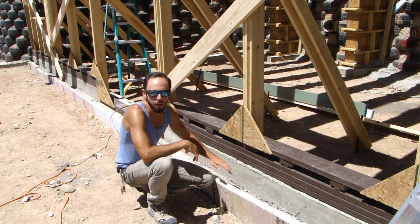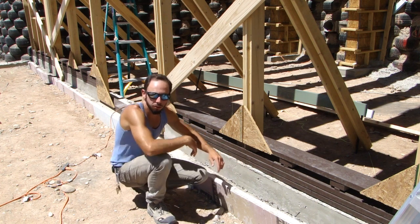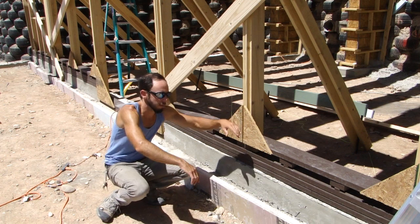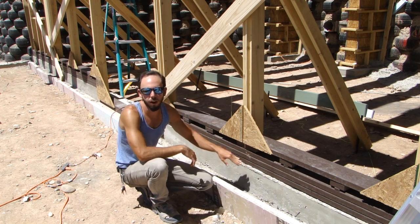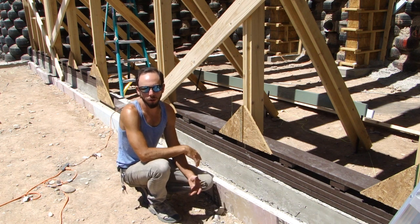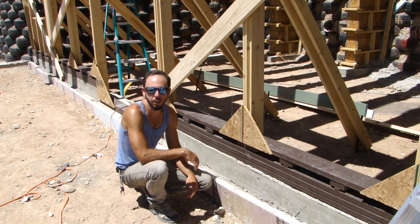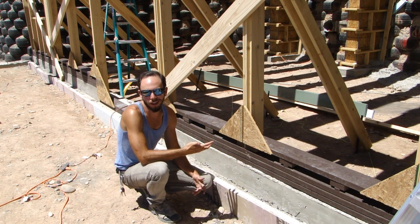As you've seen in a previous video, this right here is our stem pour. All of our window boxes go on top of the stem pour. Our entryway into the living space actually sits right on top of the footing, but our window boxes are raised up, which is why we have the stem pour. On top of that we have our Trex plating. We use Trex because it never rots. It does have a higher carbon footprint than even pressure treated wood, but over the long term it actually has a lower carbon footprint than regular wood because it never has to be ripped out or replaced — it's going to be there for hundreds of years.